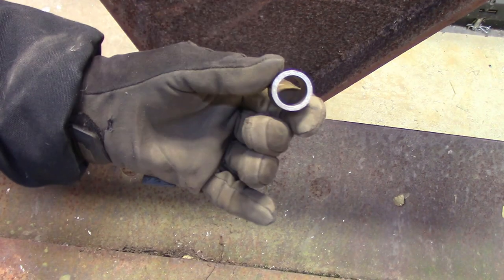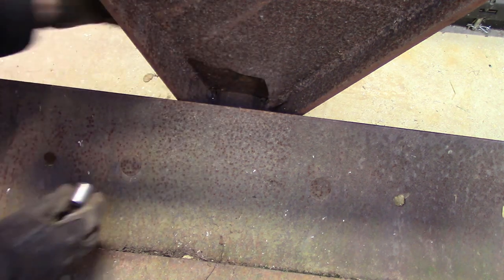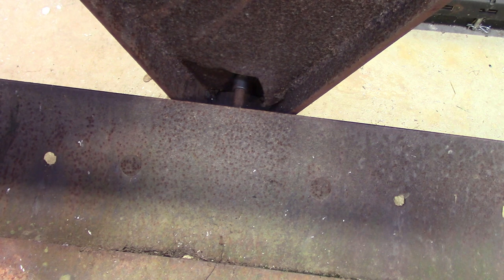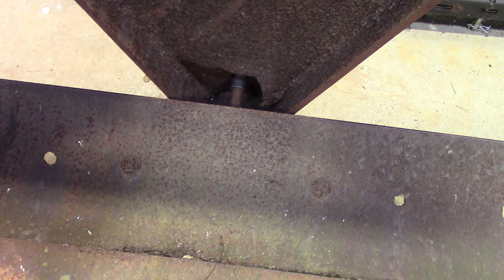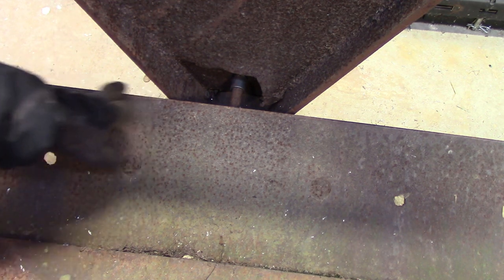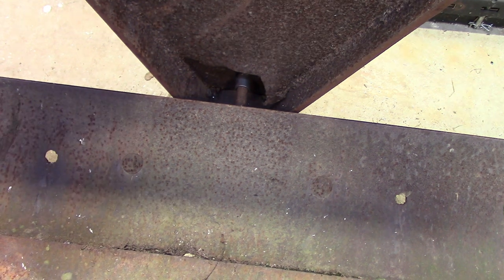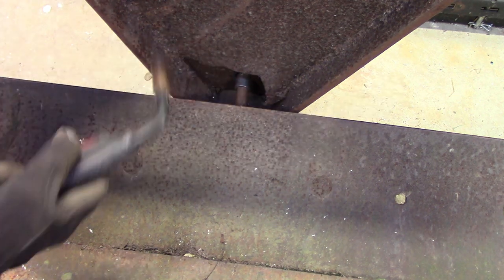I actually found this bushing that I had purchased for the flail mower repair, so I still had it laying around. It is the right size. So we'll push that in there and try and get things centered up again. Once again, I'll measure off of this flange up to the top and try and get this as square as possible. That puts us at about as square as I can get it by measuring, so let's weld this one on.